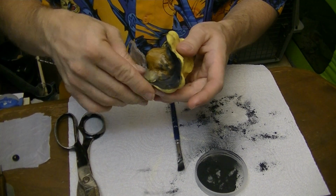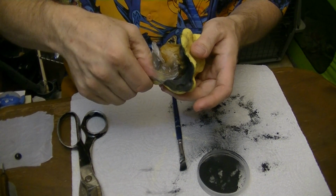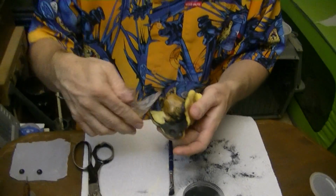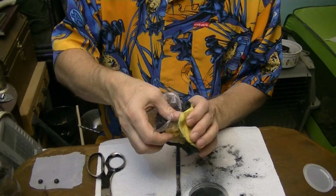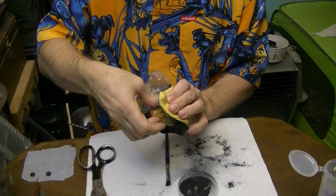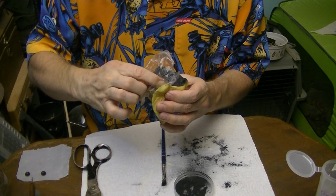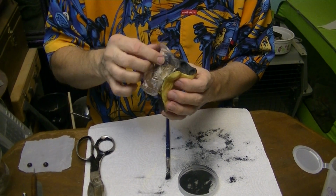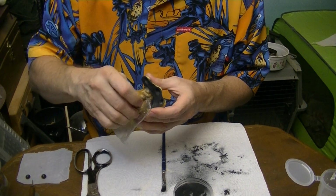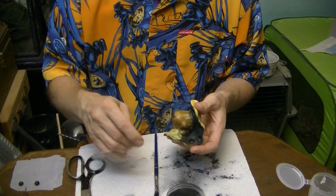You are still going to get a mold line, which you can eliminate by work afterwards. You can also try to plan around mold lines, but ultimately you usually can't avoid them entirely. In some circumstances there are techniques you can use to avoid them, but I wouldn't count on it. Figure you're going to have to either work them out at the end or place them in places on the finished piece where a mold line wouldn't be objectionable.